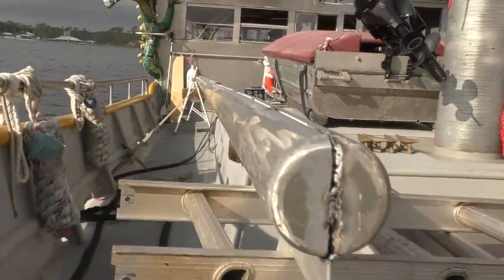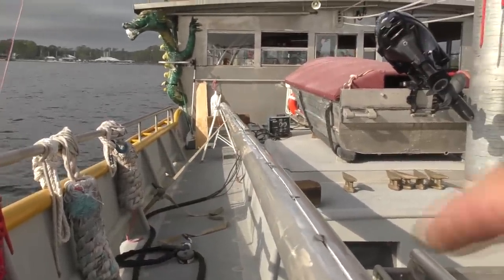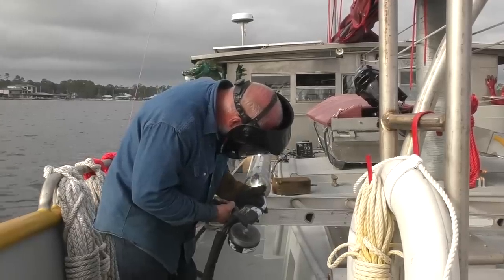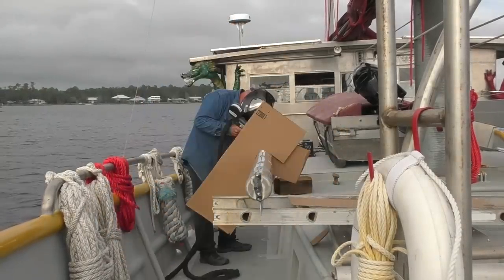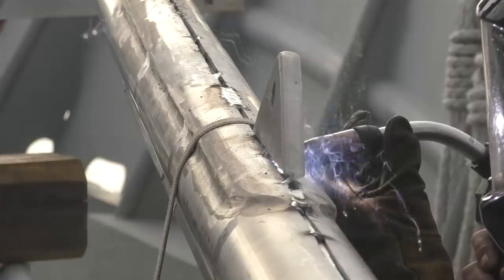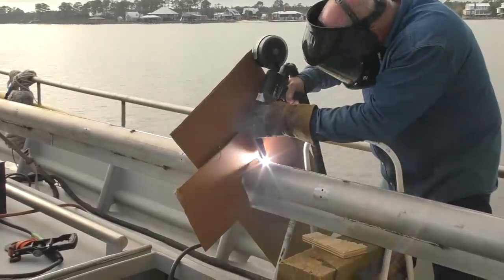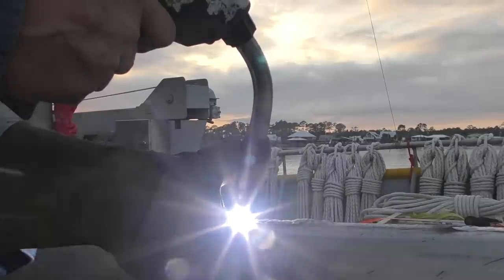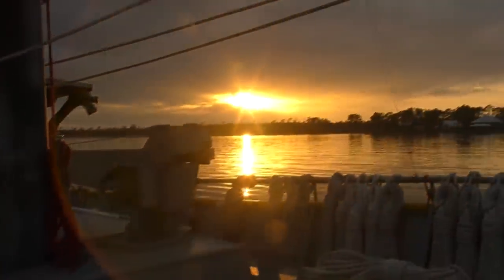Finally ready to weld the topside of the main yard. It's going to go slow because it has pretty good alignment now. I've got it braced and being pulled down in the center, because when I weld along the top it's going to make it want to bend. A little of that is fine, but we don't want it to get carried away. That's enough for today - it's taking on a bow to the side, but I think I can correct that. Gorgeous sunset.